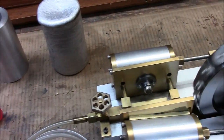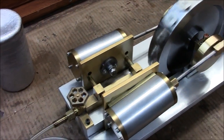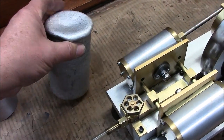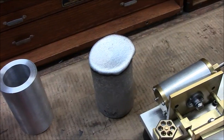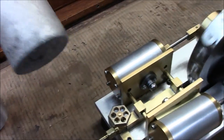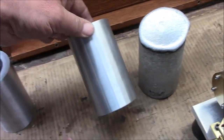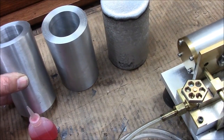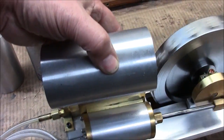What's cool about this project is I cast the cylinders myself. I have a little foundry — nothing special — but when I cast the aluminum I use old alternator bodies, screen doors, any pieces of aluminum I have around, and I pour it into a sand mold, a petro-bond mold. It comes out like this and then I turn it in a lathe. These two cylinders right here are for my next project, which is going to be a much larger engine — that'll be this winter. You can see the difference in size here.